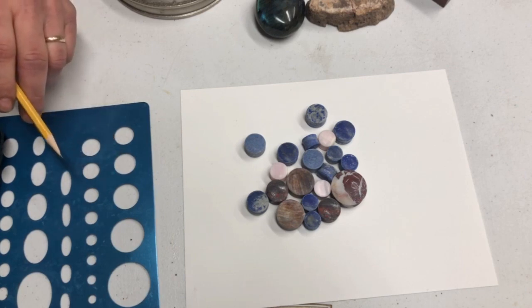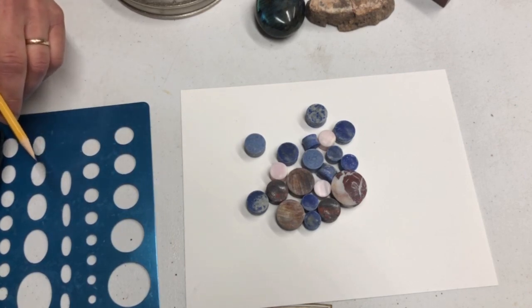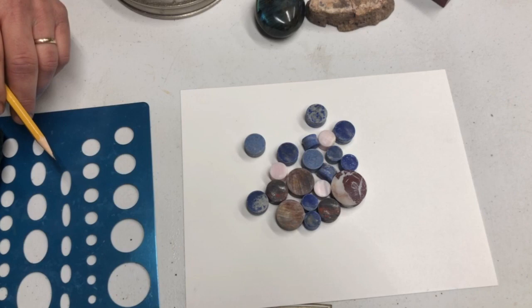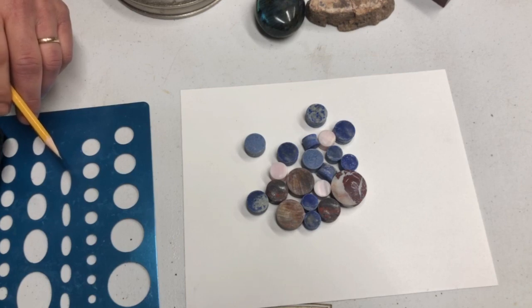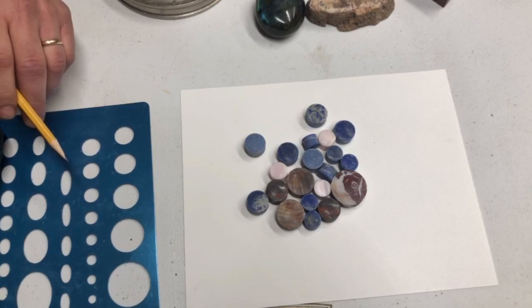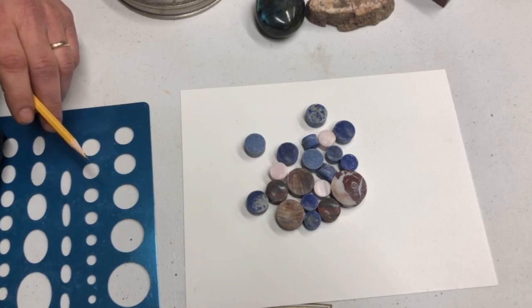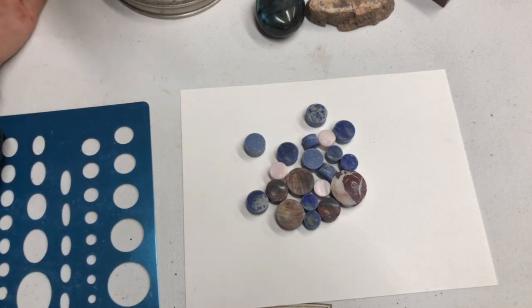Again, the shaping machine has a lot of options that you can use, and if you really want to get accurate with what you're going to cut, I suggest getting a set of micrometers and measuring the height of your stop guard and stop plate against the wheel, and then still after that run a test piece, because you will almost always end up making a small adjustment so that you get exactly the calibrated size that the user requires.